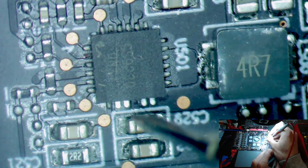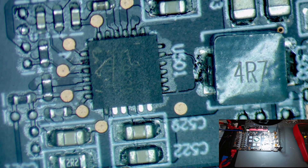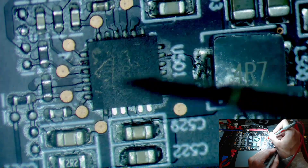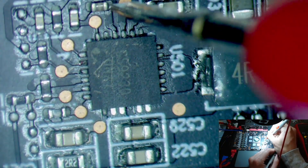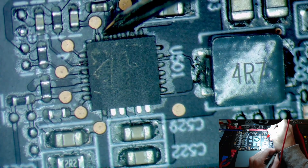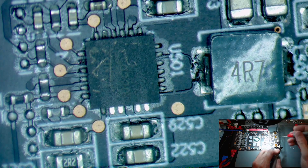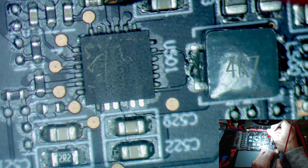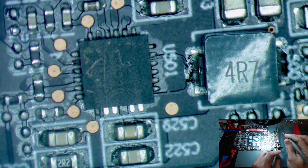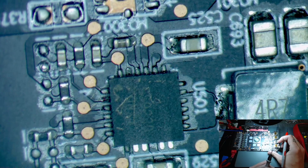Checking AN and VIN — pins 7, 8, and 9. AN has 12 volts — that's good. VIN has 12 volts — that's good. Now looking at pins 21 and 22, VCC and VIN. Pin 21 which is VCC — zero volts, that's probably not right. Pin 22 — 12 volts, so VIN is good. We are missing VCC and enable by the looks of it, and it's still outputting 300 millivolts which is a little weird. VCC is 55 kilo ohms — so neither of these are being pulled to ground, but we do not have voltage on them.